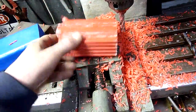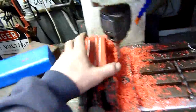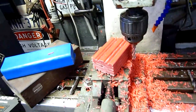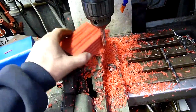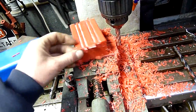This one here has to come down in thickness a little bit, or I won't get 255 or 265 mil tyres in there. I physically can't fit them in, even deflated, it's just that tight and it's a pain in the ass. So I have to keep the thickness of the blocks down to a minimum, but still have them out far enough that the metal edges that support the blocks don't touch the rims. So it's tricky.